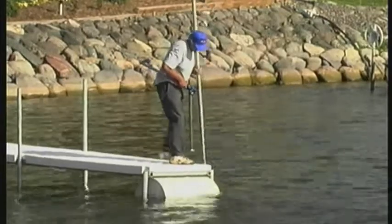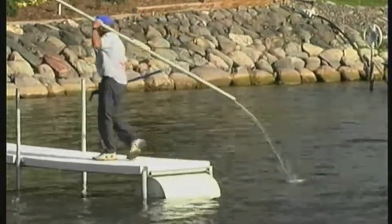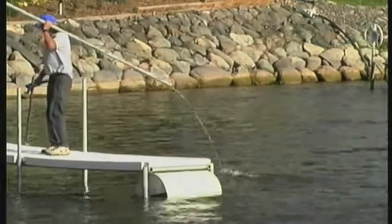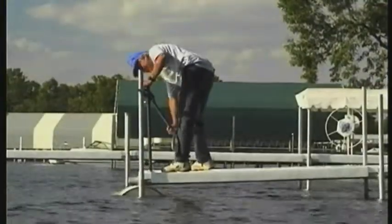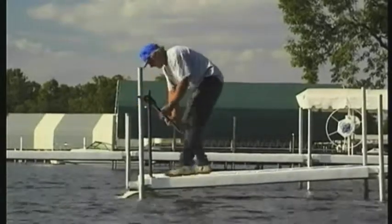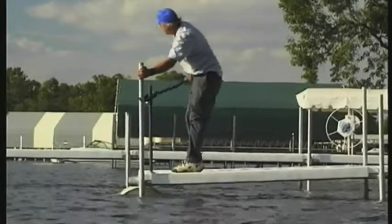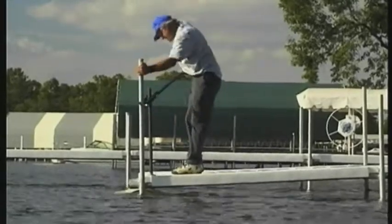Be aware of the water that is trapped inside the vertical pipes. Drain the water into the lake, and not on the decks, to keep your clothes dry and eliminate the possibility of ice inside the pipe, which may cause splitting during winter storage. The memory and tensile strength of the framework pipe, along with the design and strength of the bracket, allow you to use all 490 pounds of barrel supports when trying to break the suction from tough ground conditions.